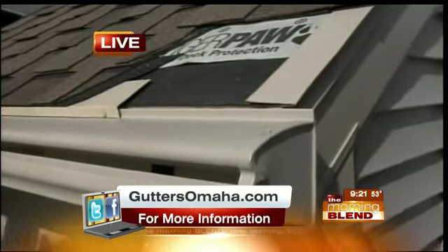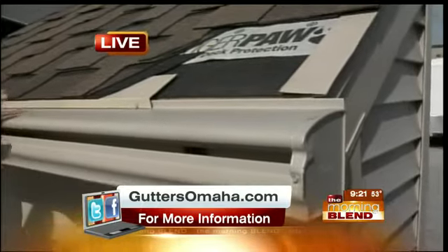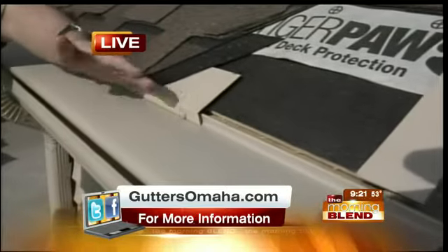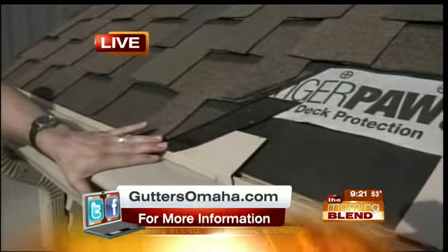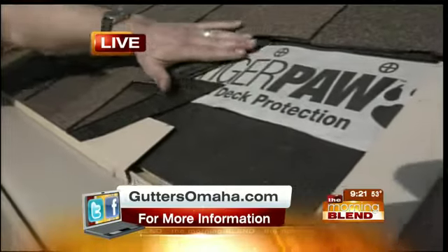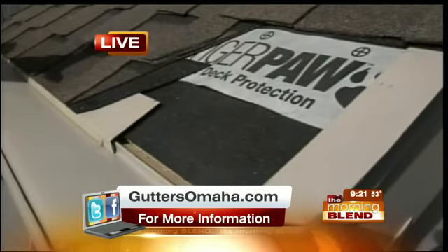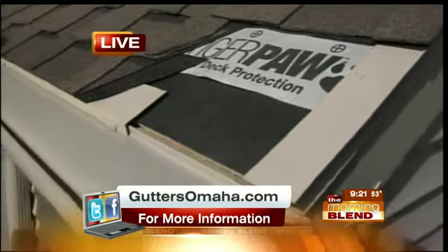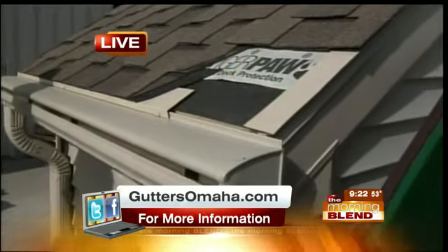So what am I looking at here? You've got a nice piece of the Leafguard gutter system on the outside, with gutter apron or flashing creating a seal between the gutter and the roof edge so nothing can leak behind the gutter. We have starter strips rated at 130-mile-an-hour wind rating. Then on top of that are the shingles, with ice and water shield and then the Tiger Paw underlayment — a synthetic underlayment. A lot of folks are used to felt paper, but this is actually way stronger and protects against moisture much better. So if something were to sneak through the roof, your roof deck and the inside of your house will be protected.